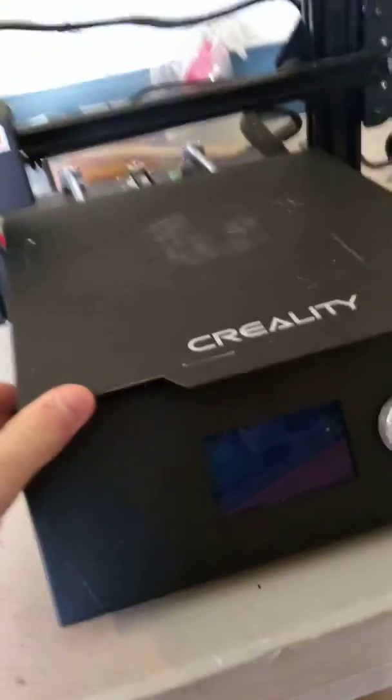I think that's mostly all I've done to my printer, but it's been printing a lot better. You also might want to change out the fans, because the fans are really loud — I haven't done that yet, but I'm going to, because they are extremely loud. I would also oil some of the bearings and rods back here, because they can be some screechy loud rods.